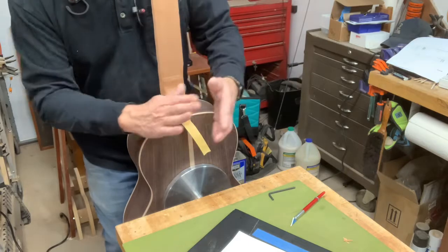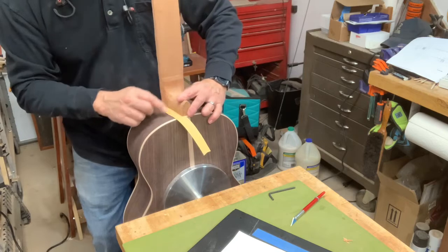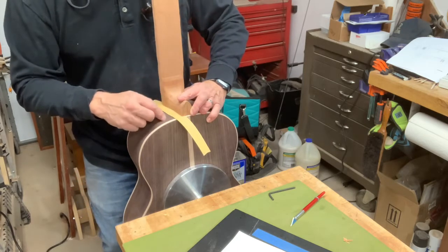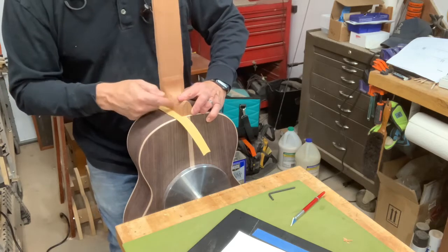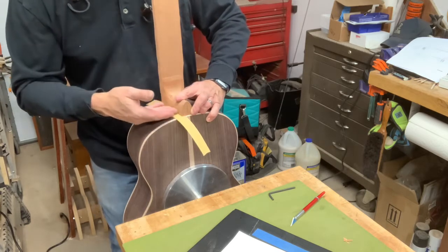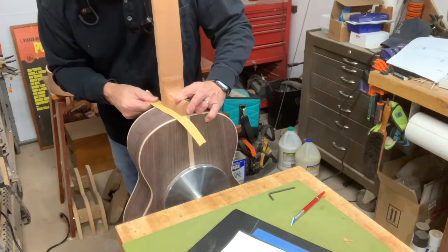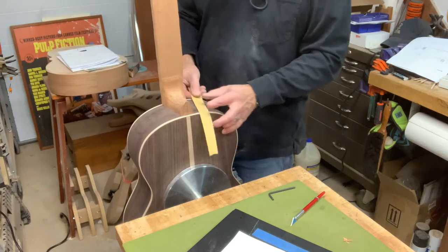So this is a great way to make something fit perfectly together, because you're using both surfaces. If there's any discrepancy in any surface that you're trying to stick it down to, it's going to sand this exact discrepancy in the other piece, if that makes any sense. So you just slowly pull it through there, like that. And you got to do both sides,